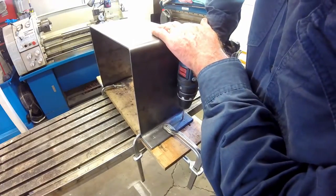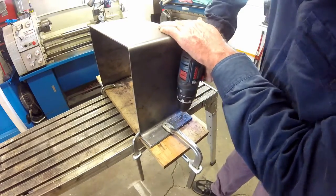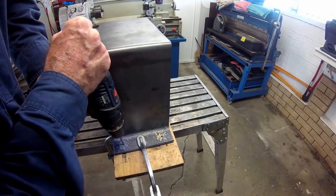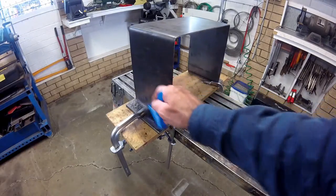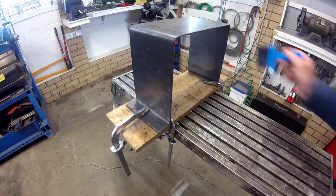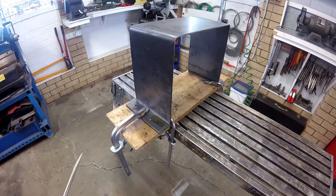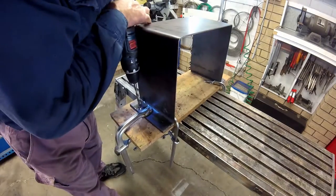The battery box hangs under the tray back and is attached to a mounting bracket located on the top side of the tray. The mounting bracket consists of a flat strip with two studs which pass down through the tray floor to hold the battery basket. There will be a mounting bracket on each side. The studs will be made by welding two bolts to the flat strip, but here I am drilling matching holes in the mounting bracket and the battery basket — first running a pilot hole and then a larger drill to match the size of the bolts.